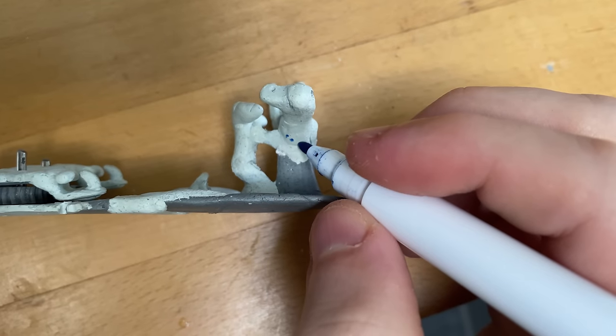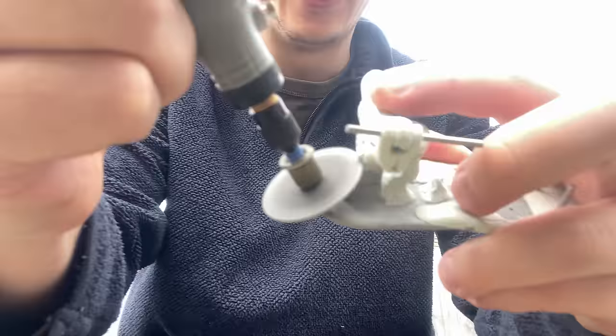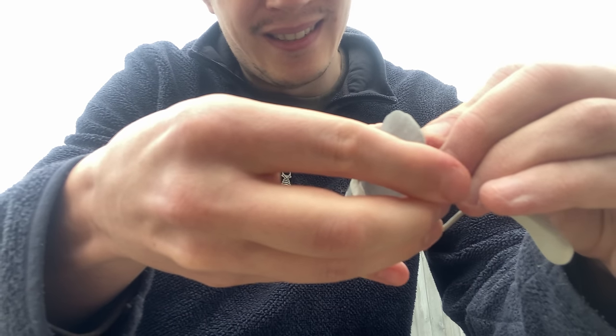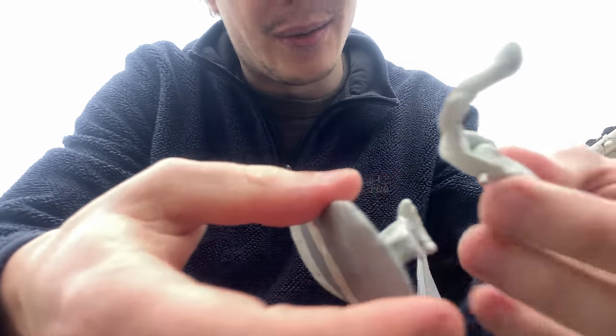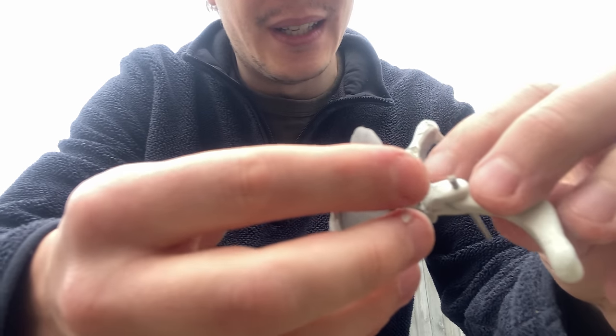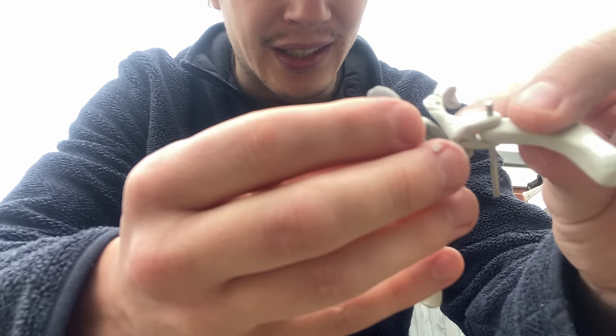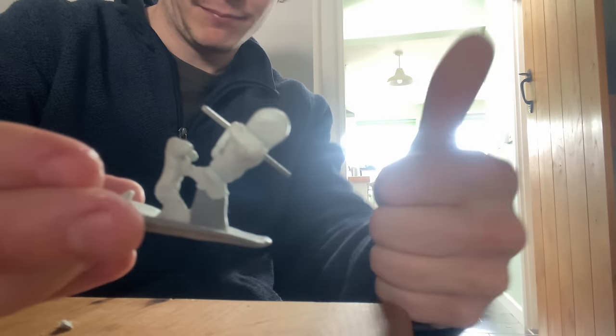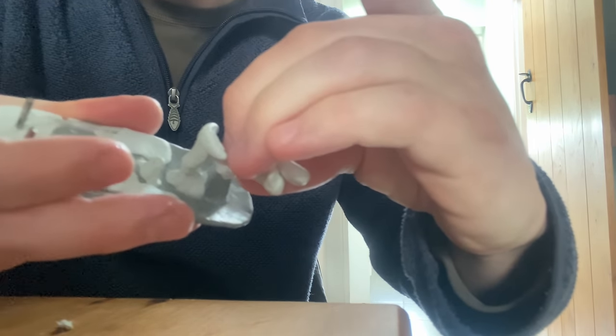The S-shape of the cable trajectory of the finger mechanism helps a lot — it ends up facing the same way it was facing to start with but after those two turns. If those two turns were done in a Z-shape as opposed to a nice smooth S-shape, each of those hairpin tight corners would incur way more friction than we want. So thinking about that, I considered another way to smooth the trajectory of the wing mechanism's cable. I re-angled the lever to follow a more diagonal trajectory as opposed to one that goes straight outwards, and this would reduce the angle and therefore reduce the friction.